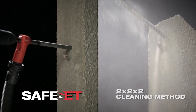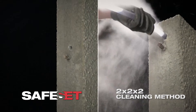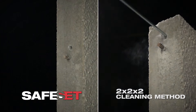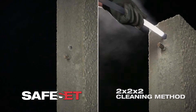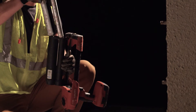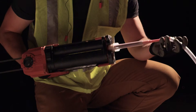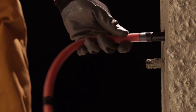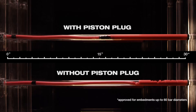Contractors can now do lap splicing applications by drilling a hole, either with Hilti safe-set installation methods, which require no hole cleaning, or using standard drilling and hole cleaning methods. Once the hole is prepared, you inject the adhesive using Hilti's best-in-class installation accessories, which includes the HD battery dispenser and piston plug. The piston plug helps properly inject the adhesive evenly, without creating air voids, to help ensure full performance.